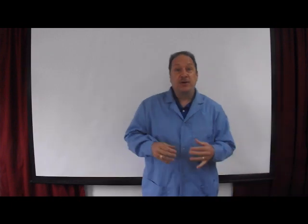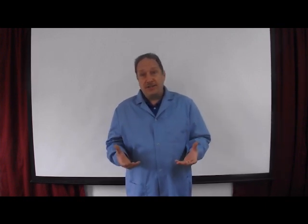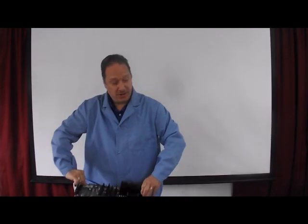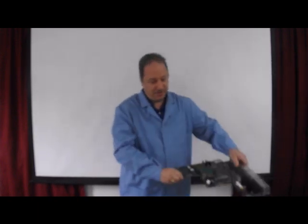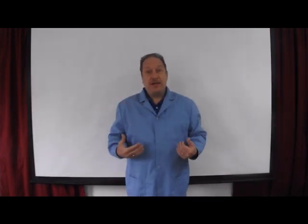What we're talking about is working on big, thick boards, large chips, or boards that are sensitive — heat sensitive, or have heat sensitive components. Ideally, if I'm going to be working a thick Sun Systems board, or a Cisco networking systems board, or an LTX board, I need something that will give me a lot of heat, and I need to have even heat. I don't want these boards getting heated unevenly and warping.